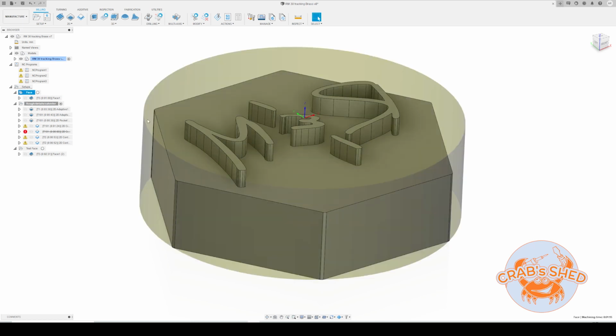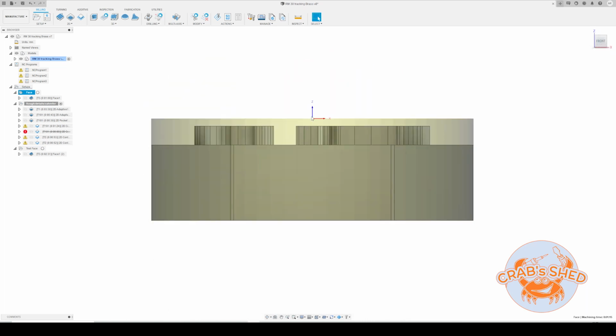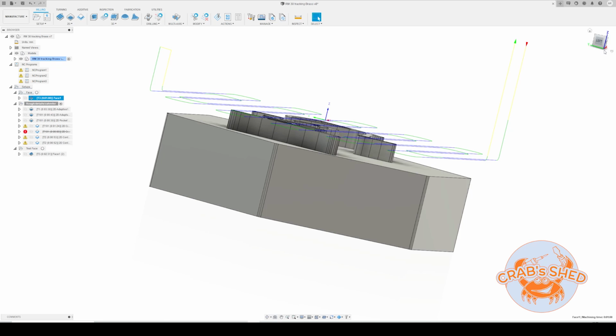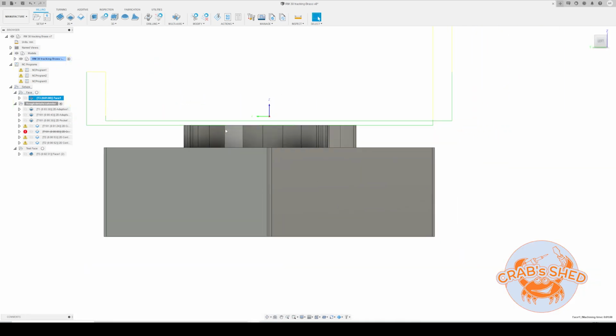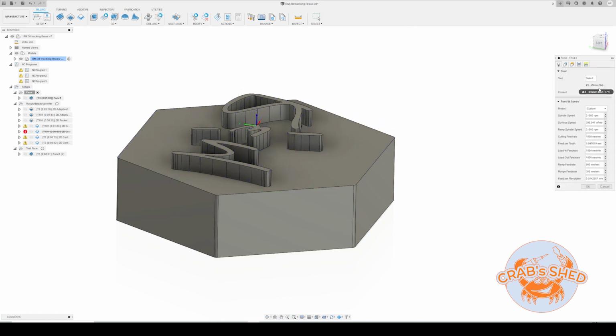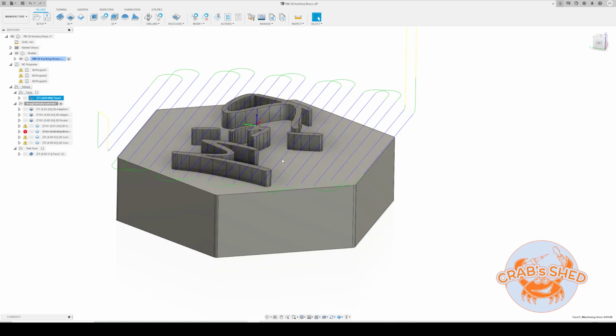There's basically two parts. One setup is set 1 millimeter above the part, in order to do the facing operation so that everything is nice and flat, and it's done with a 6 millimeter single flute end mill. All operations are set to 21,000 RPM. For the facing operation, I set it to 1000 millimeters per minute at a 0.5 millimeter step down and 4 millimeter step over. And yeah, it worked okay.